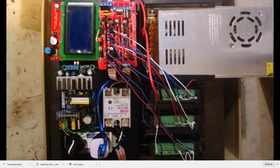Okay, so for controllers, this device right here can control all the machines that I've shown before. This is just the Ramps Marlin Arduino toolchain. This is applicable to Cura. We're actually using Marlin. We're asking, what's the simplest thing we can do for multi-axis machines? So certainly you can do three axes. This is a three axis system with external stepper drivers for the CNC torch table, or you can use the onboard stepper drivers, without the larger green external drivers, for applications like the circuit mill or the 3D printer.